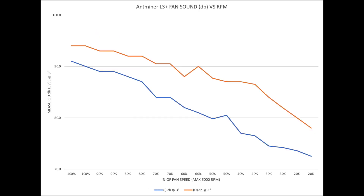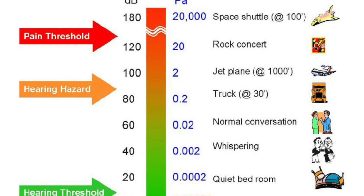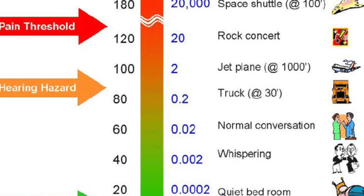Here's what it boils down to: keep it at white noise or below, keep it at conversational level or below, and you can keep running these things in the home. Once we get below 50% RPM, we're generally sitting at a dB level that's acceptable and easy to muffle without a lot of work. The less we muffle, the less we have to be concerned with heat. I hope you found this useful — please visit asicbasics.com, subscribe on YouTube, and feel free to hit me up with questions or video ideas.